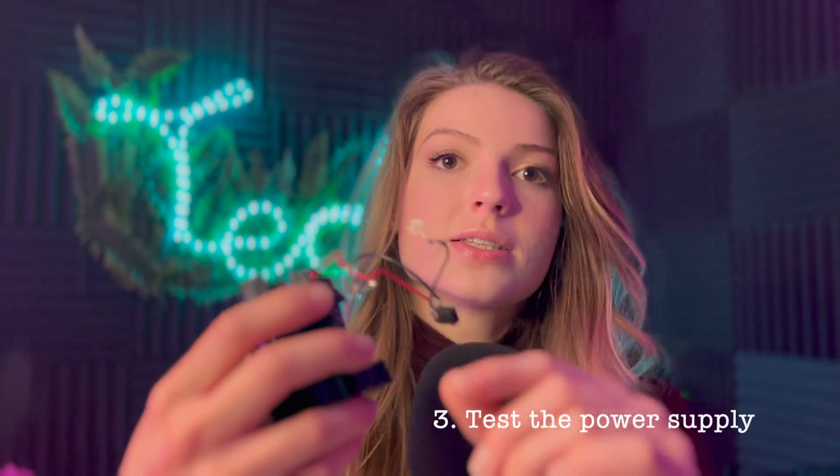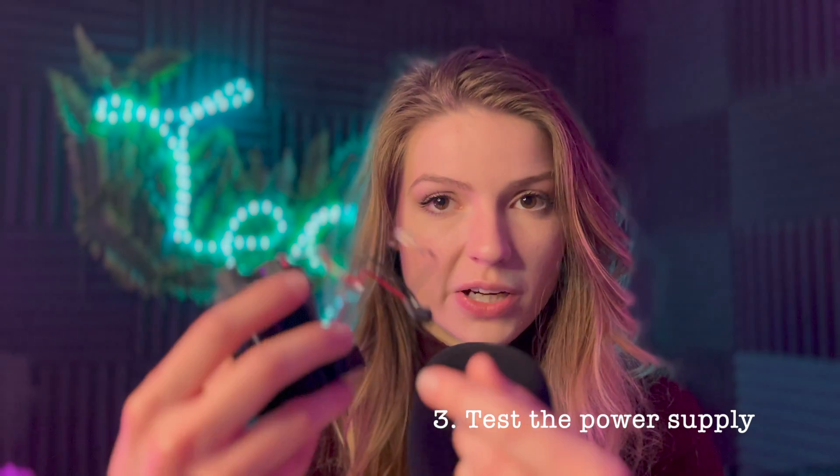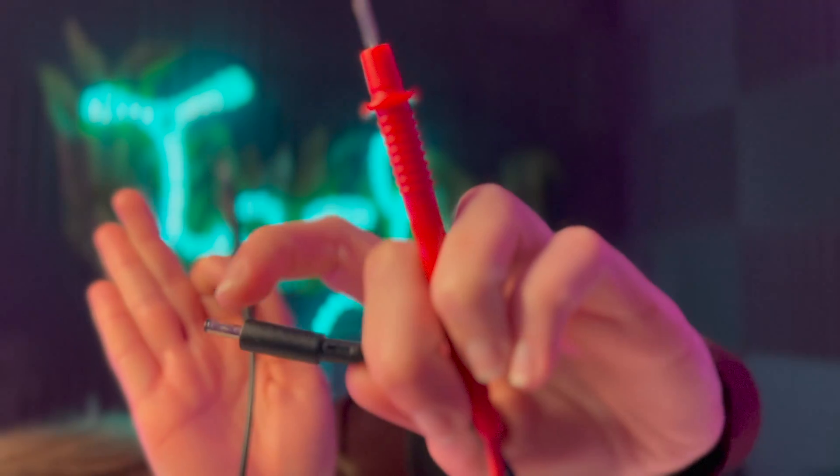When I test the circuit, the first thing you test is the power going to the device. You want to make sure that whatever adapter you're using is working. This was brand new so I didn't have much doubt, but I tested it anyway. The outside of this connector is negative, so put the negative probe there, and for the positive, wrap a small wire inside the tip to make contact.